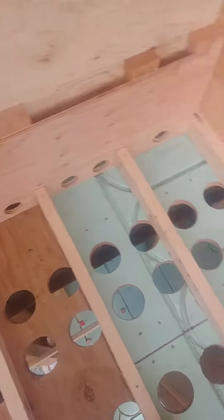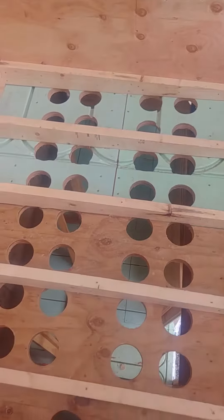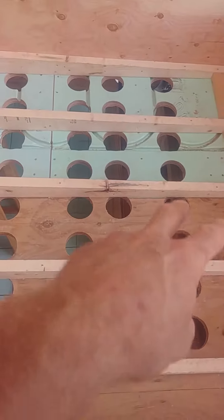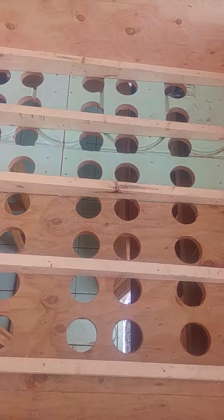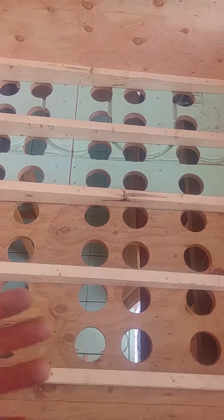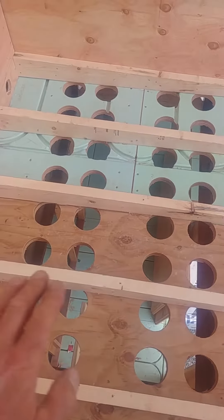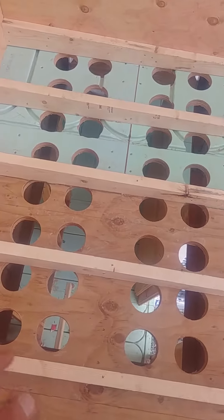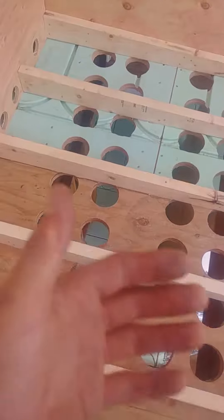What we do here in this particular case is vent this roof. There's going to be insulation below because this is living area. These holes are all drilled here. That space below is living area, so it creates heat and moisture. So what we need to do is ventilate underneath it. When the insulation gets put up against the floor — because this is outside area — any moisture that builds up in there actually has a way of venting out.